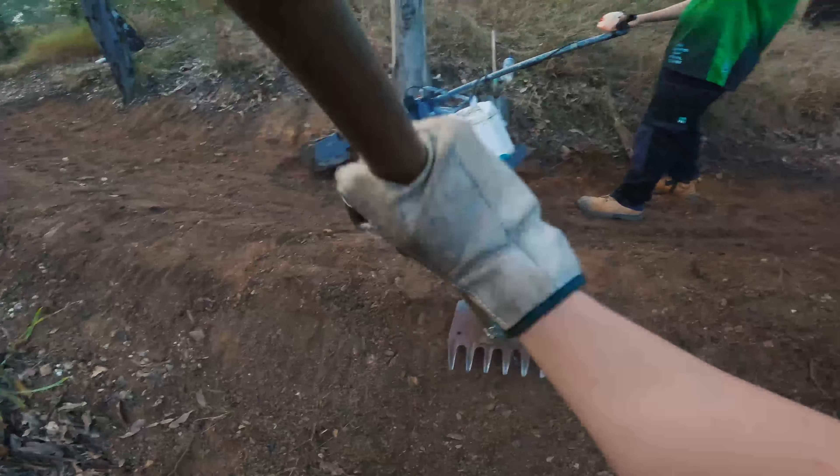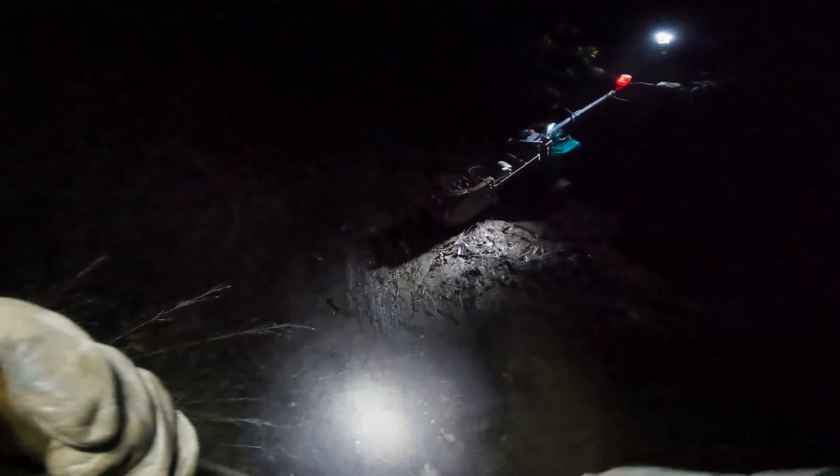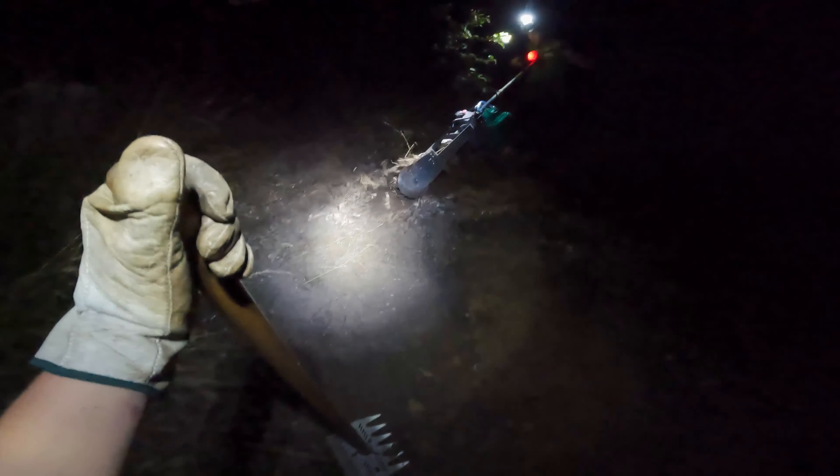Often the digging will start while you're still in bed. Here on the Jinkie track we start at 5 a.m. on a Friday morning. When starting a new section we look for major issues. You can see there that the drain hasn't worked too well and the water's built up down there, so we're gonna make it a bit bigger.